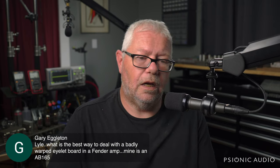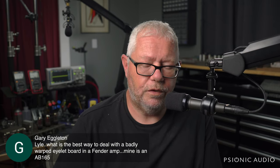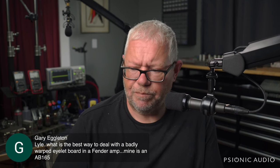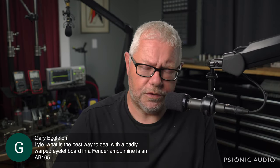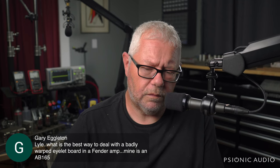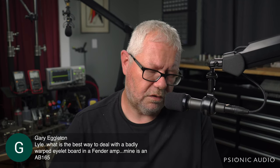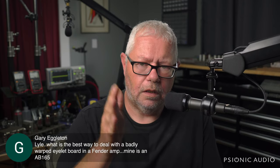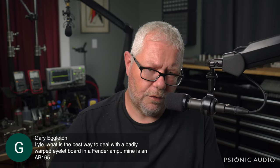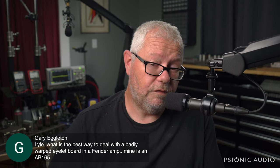Hey, Gary, usually the only issue with a warped eyelet board in a Fender is the horizontally mounted resistors, like the slope resistors, that 220K in the vibrato circuit, and then the 100 or 47 ohm in the phase inverter to ground. Those will pull out if the board warps, and the rest are usually running more on the non-warping plane. But if it really bothers you, you can take the board and remove the three screws